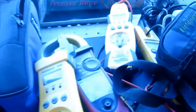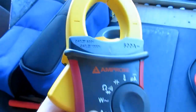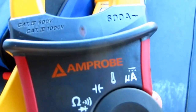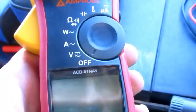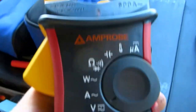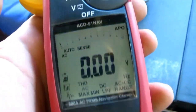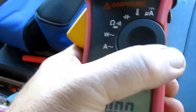Some of my other meters I got here. This one here I bought for inrush — it's an Amprobe, the 51. But this one won't read the micro millivolts on DC for checking thermocouples and power piles and stuff like that. I can't get it to work. I went through all the ranges and everything, so this meter is not going to work for me.